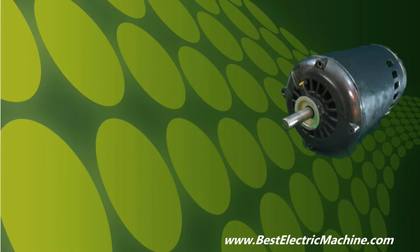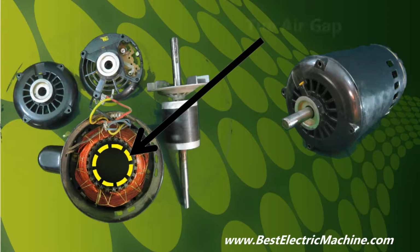Third component, the air gap separating the rotor from the stator, where the speed-synchronized rotor and stator rotating magnetic field vectors superpose to establish the air gap flux density and to provide the electromechanical power conversion by pushing or pulling on the other's magnetic field in accordance with the electrical excitation frequency and voltage, directly applied to the terminals of the balanced multi-phase AC winding set of the stator.